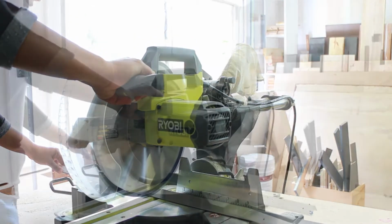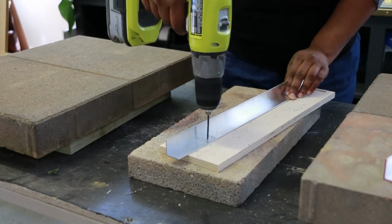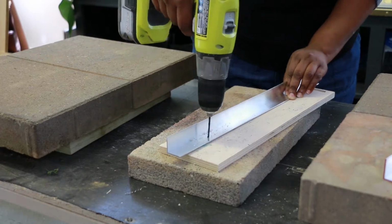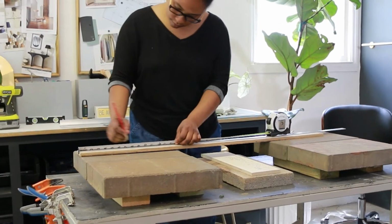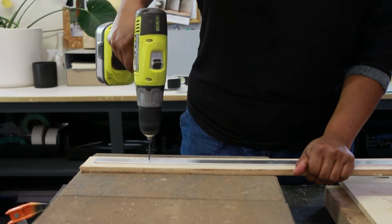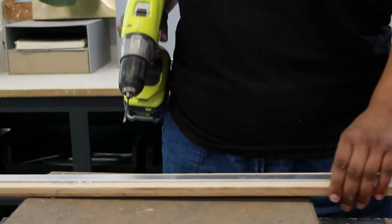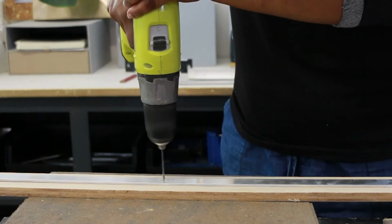Cut 2 pieces of an angled aluminum bar to the desired width of your trellis and drill 2 to 3 holes along one edge. On 2 flat aluminum bars, mark where you want holes drilled for the trellis wire to loop through. Be sure to drill your holes a 1/4 inch from the edge. Use a cobalt bit, but take your time doing the drilling.